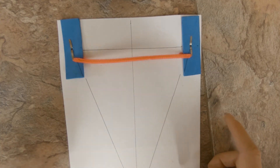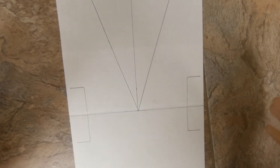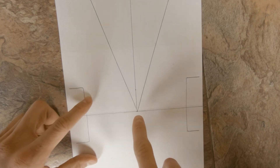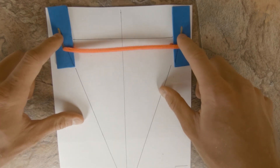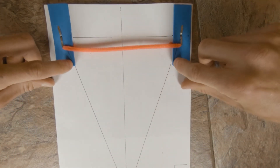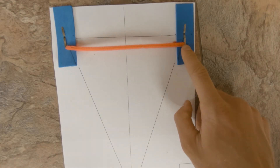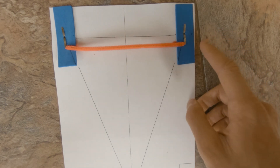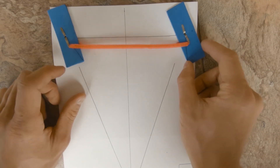My model is not very good but it should give an idea. As you turn, this tire has to turn sharper than this one. How you do that depends on where your tie rods mount under your buggy. The way you can find where your tie rods should mount is you scale down your whole buggy to fit it on a piece of paper, then draw lines from the center of the rear axle to the intersection on both front tires. Anywhere along that line gives you perfect Ackermann. The issue is we can't move our tie rod mounting locations because we're using Miata knuckles.